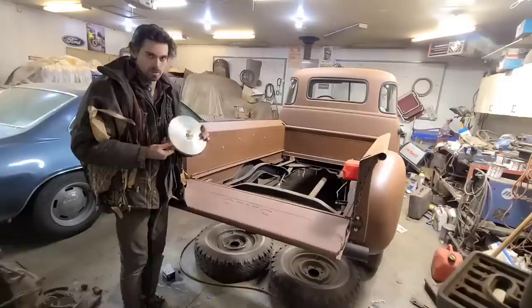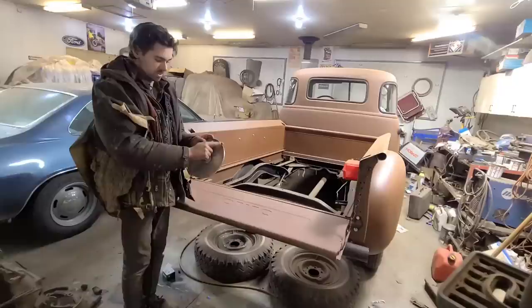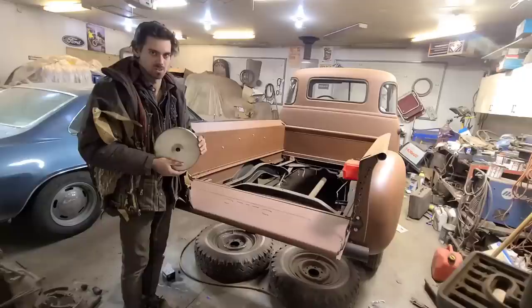And then the final thing, which is probably just a personal thing, is I didn't like the fact that there's a spinning steel disc spinning at thousands of RPM on a grinder. Even though the edge is turned up, if that gets a hold of human flesh, it's going to do some serious damage. I don't like having anything sketchy spinning around at that kind of RPM, whether it's broken cutoff discs or whatever. I try to avoid that.